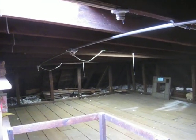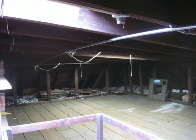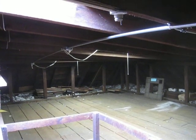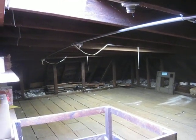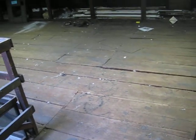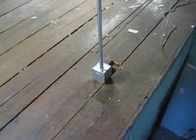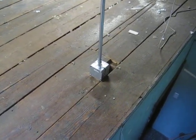The second floor front also shares with the first floor front porch. There's a switch as it goes out to the front porch from below the second floor front bay windows. Loose floorboards existing in the attic were used as a wire way, front to back, mostly for the third floor. Circuits also come out of the distribution panel in the third floor hallway below this junction.